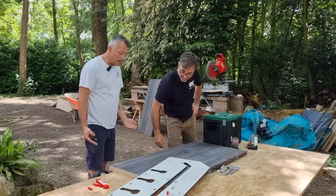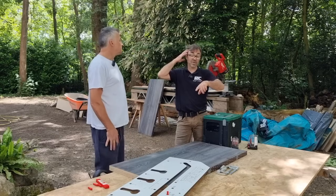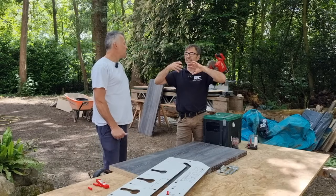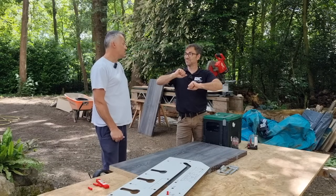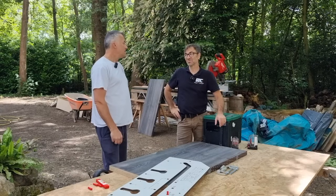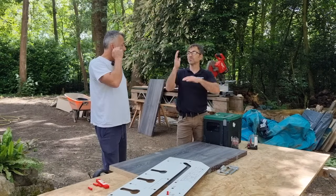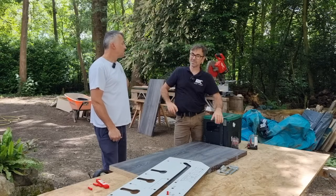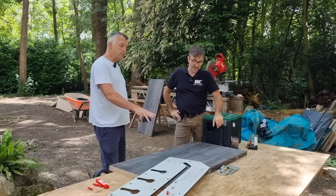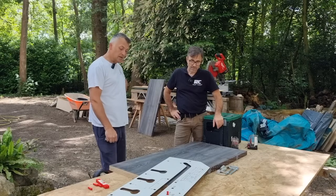For demonstration purposes, this piece will be the female joint and then a male goes into that. A lot of people who try this for the first time don't realise you do one from the top and one from the bottom, depending on which way the router spins. Working from the bottom is a bit nerve-wracking because the length of cut sticks through, but as long as you keep it in the jig it's solid.